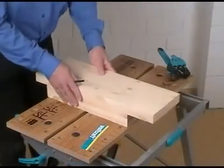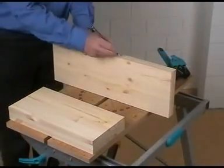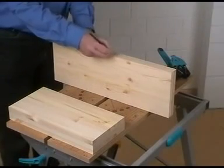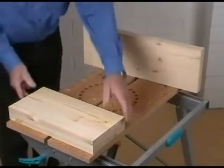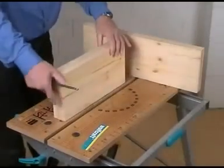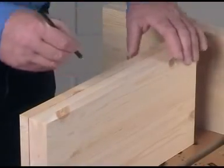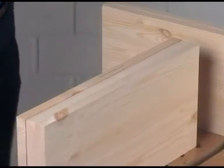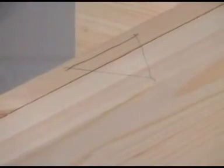Before you start doweling, all boards should be marked at first, so that they cannot be mixed up. For this, firstly you place the two side walls together and mark a triangle on the leading edge. You do the same with the bottom, intermediate bottom and top. With this so-called carpenter triangle, the positions of the wood pieces are definitely determined.